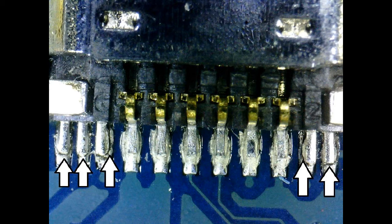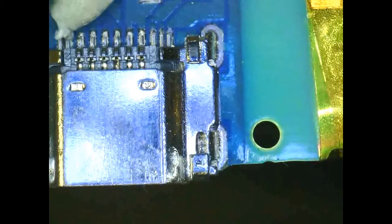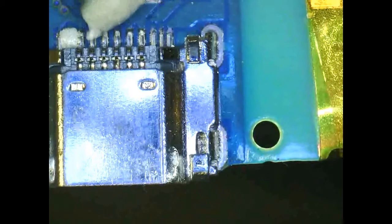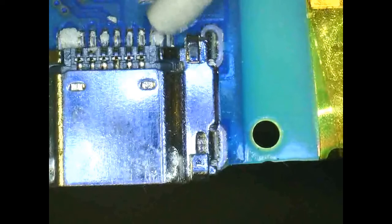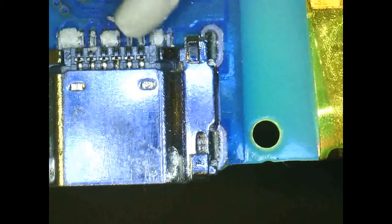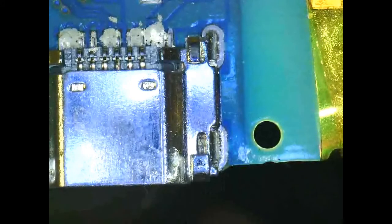To start off, you want to go ahead and heat the bottom of the board. You need to cover up any components or any plastic that you think might get damaged. As you can see on the right side, there's a bit of kapton tape covering the microphone because the microphone can get damaged in this particular repair. Then once you've heated the board up, you're going to add some solder paste to the areas where you need to. The amount I put on is actually too much for this particular repair, but I've done that intentionally so I can show how to fix having too much solder.